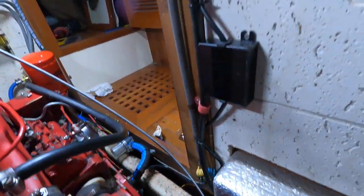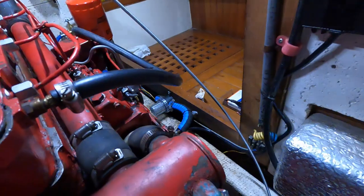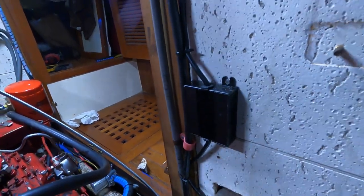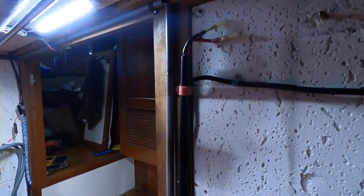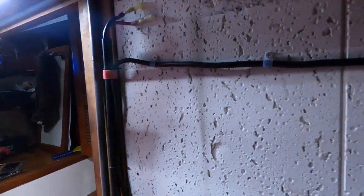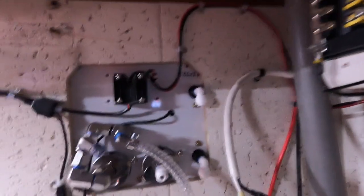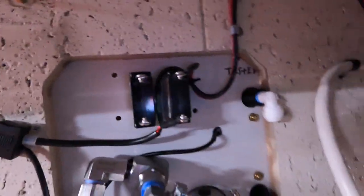So we've got the pump over there, the boost pump, sorry, that comes through. Then it goes to this controller, which goes up, and this is a 12 volt DC, remember? So the boost pump goes over, and I've got it hooked into the 12 volt DC side, and then it comes into my fuse panel here. Technically that's a fused breaker switch, but I just believe in redundant fuses.